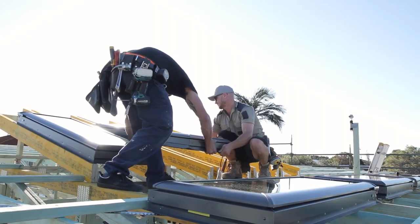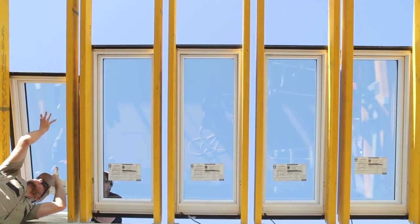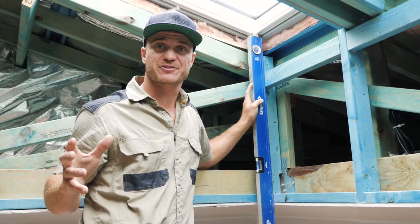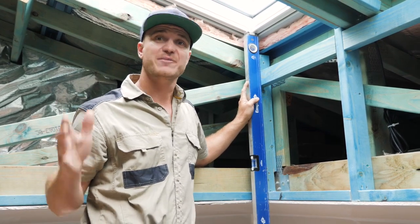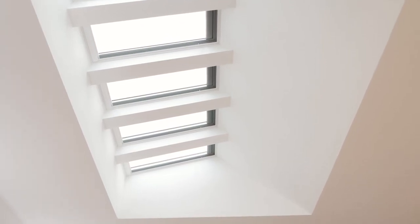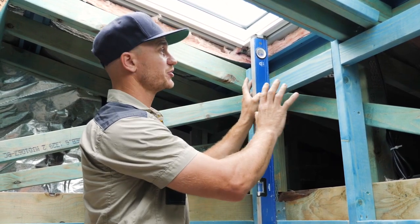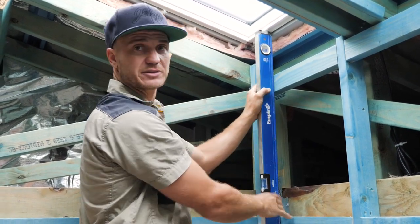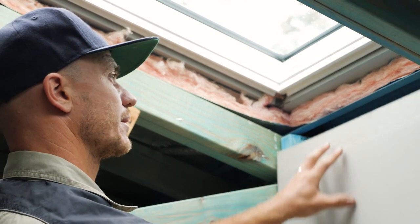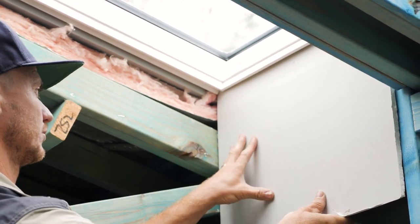The boys have been working hard on the roof — they've installed the Velux from the exterior and now it's Kyle's time to come inside and frame up that void to create an architectural feature. Now that our skylights are installed, we're ready to start framing up the light shaft. The most important thing we can do here is create a splay in the light shaft to capitalize on all that natural light. We're using the back of the rebate in the skylight as our starting point, and a spirit level to ensure that we are plumb when setting out the frame. The Velux Skylights are designed with this rebate, and that allows the gyprock to tuck right up in there, creating a perfect finish.